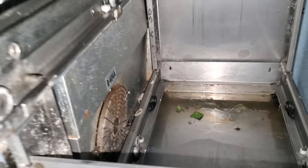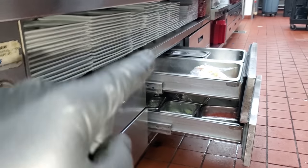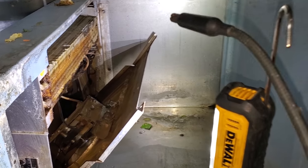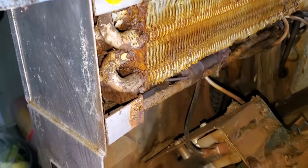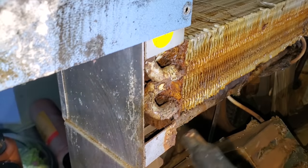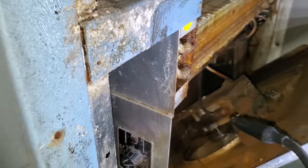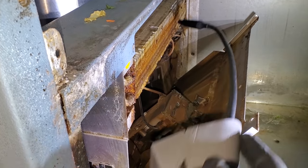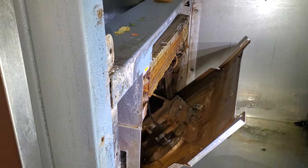I'm on their plate chiller right now. Unfortunately, because of the design, you've got to pull the cages out to get into the evaporator. I have this one left to do, and then they have a waitress run on the other side. I already did the one where we put a temp control in — there are no leaks on that one. This coil is nasty. I mean, just off of principle it should be changed. Look at how corroded it is — it's just rusty. Surprisingly, I'm not picking up any leaks in here. It's just all rusted out. We'll talk to them about that one, but we're going to keep going trying to find where this leak is.